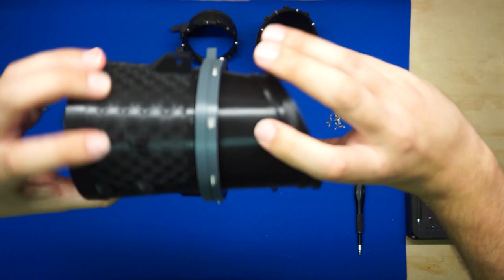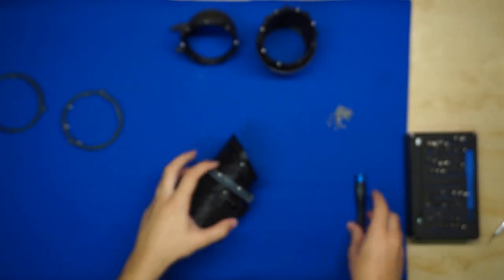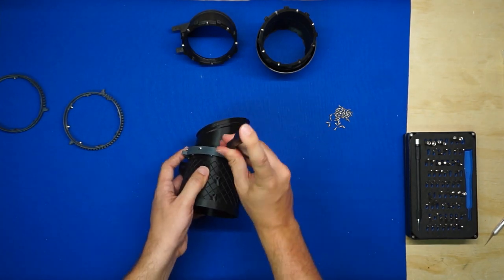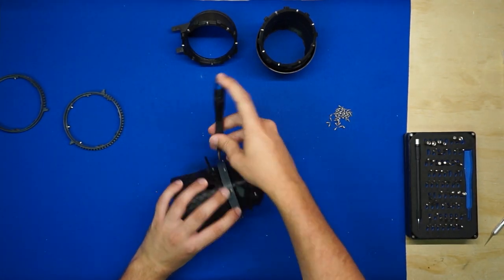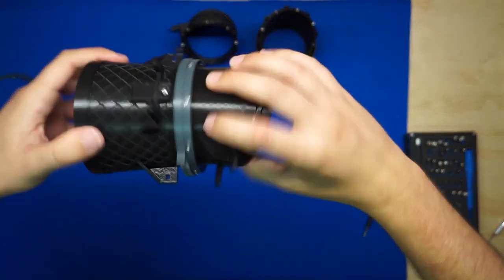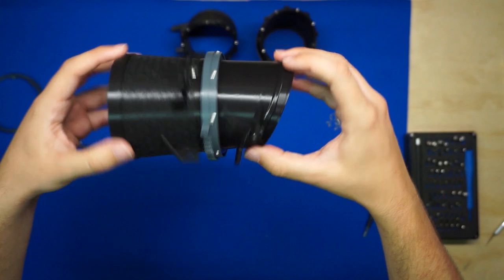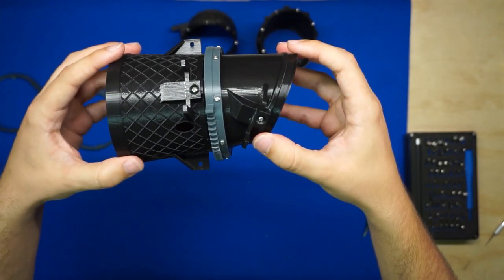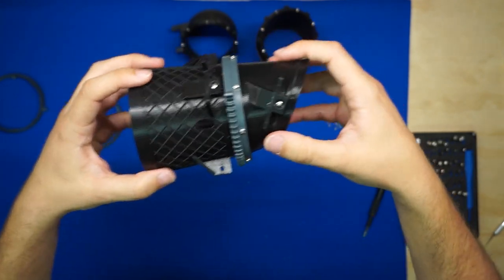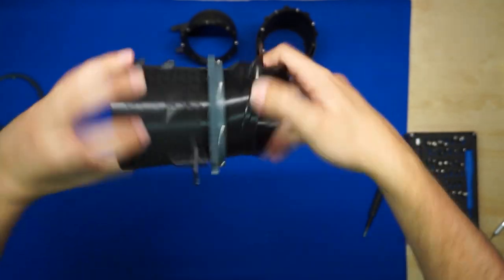All right, I've got my initial screw installation done here. I'm going to go and do the final tightening now. So once you've got those all tightened down, go ahead and check the rotation of the 3BSM. It should be able to be pretty easily rotated without much force, and it should not be sloppy. Make sure you can't wiggle it and flop the sections around. But also make sure it's not sticking. This one's pretty good, so we'll just move right on to the next section.